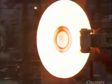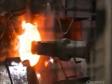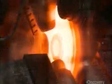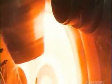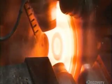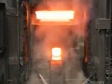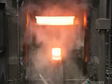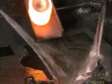The train wheel is 76 centimeters in diameter when a robot removes it from the press and delivers it to a rolling mill. The mill squeezes and shapes the wheel until it expands to 91 centimeters in diameter, a 20% increase. The train wheel then enters a final shaping press that punches out the hole where the axle will go. All excess material goes back to the melt shop for recycling.